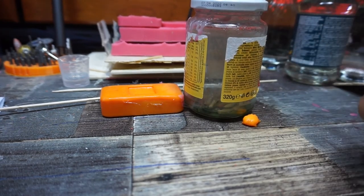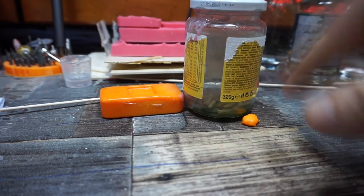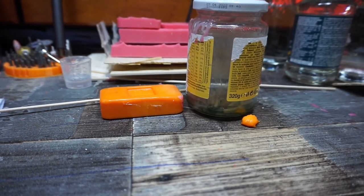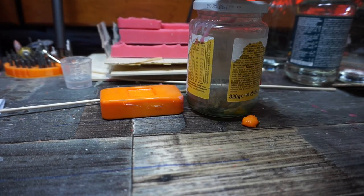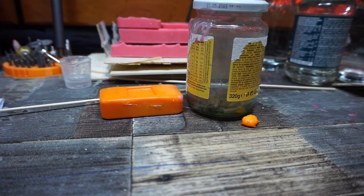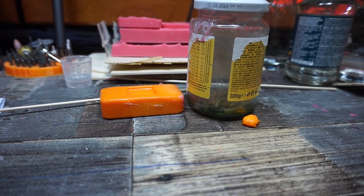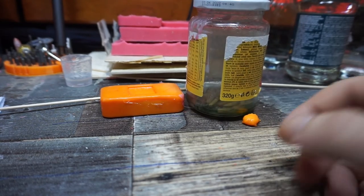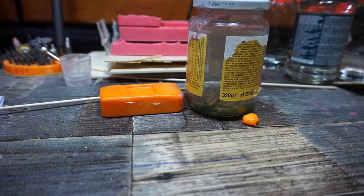In the jar I have some acetone and a few broken sticks so everything I drop in doesn't lay in the acetone directly. I take this jar and drop it on the heat bed of my 3D printer. Don't close the jar tight or the vapors would crack the glass. Always keep an eye on it, because putting acetone on a heated bed — just be careful. But 30 minutes in this vapor bath and almost everything is super smooth.